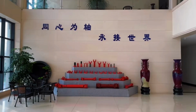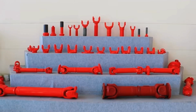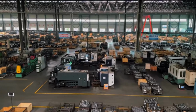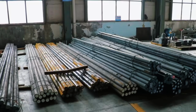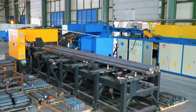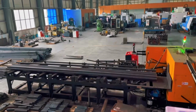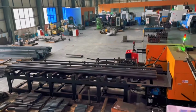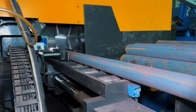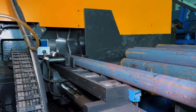It all starts with a material, steel. But not just any steel. Special alloys of chromium, molybdenum, or manganese steel are used to manufacture axles, selected for their resistance to torsion, tensile strength, and fatigue. The steel arrives in large bars or billets, which are stored under controlled conditions. Before entering the production process, each batch undergoes chemical analysis in a laboratory, where its exact composition is verified. Only batches that meet customer specifications and international standards continue in the process.